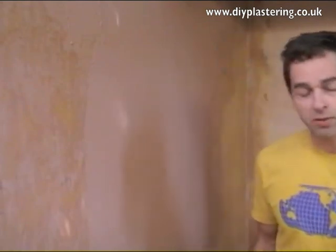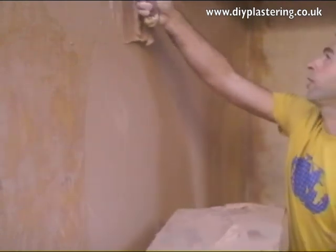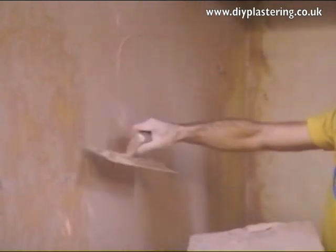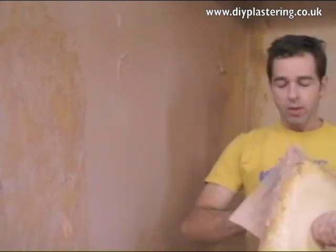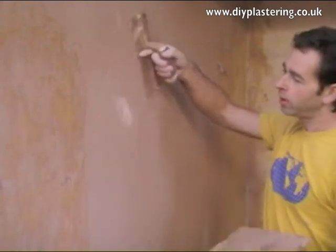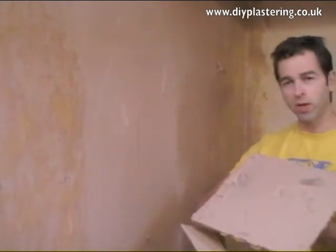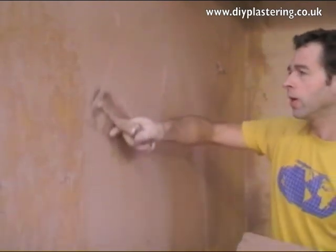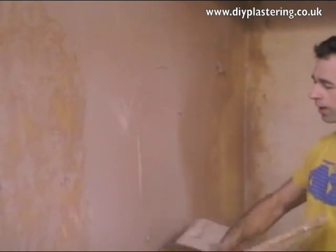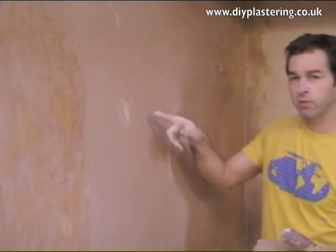The flattening off is done, so now we're going to put the second coat on. With the second coat it's exactly the same but a bit thinner — smaller amounts on your trowel, looking at about a millimetre thickness. Again, a flat even coat. You need to push fairly firmly because if you don't, when you run your trowel over you just leave a series of holes. You need to push hard enough to force the plaster along the whole length of your trowel and into those holes. If I don't put the pressure on, no matter how many times I stroke it, I'm leaving those hollow areas.